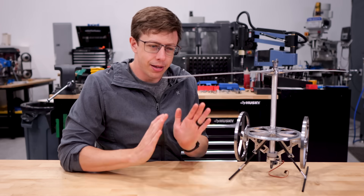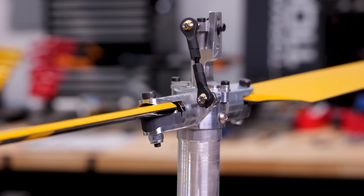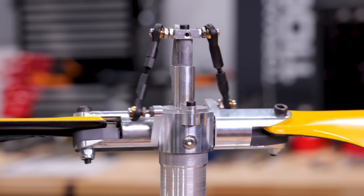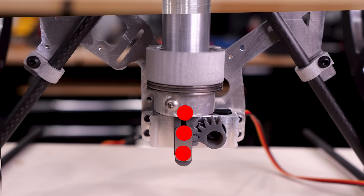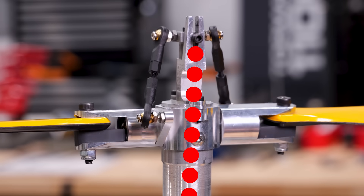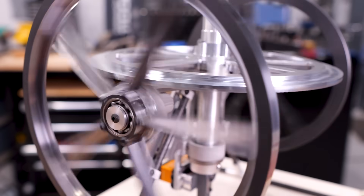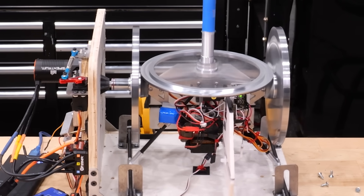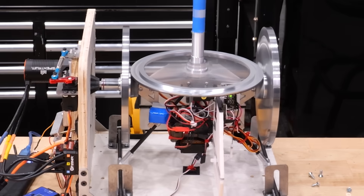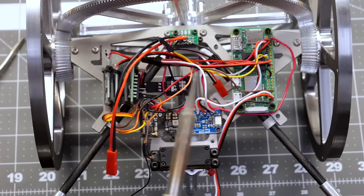All the parts are made and put together, and it looks really cool. The most important part is the rotor head — the blades are on a pivot so we can change their angle by pushing and pulling on them while they're spinning. The secret is a little servo on the bottom which is stationary while the blades spin, but has a control rod that goes up through the main shaft to push and pull on the blades. The lower part is built around the bevel gears at a five-to-one ratio, meaning the flywheels spin five times faster than the blades — up to 24,000 RPM — so they have to be very well balanced. The middle holds all the electronics for control and altitude measurement.